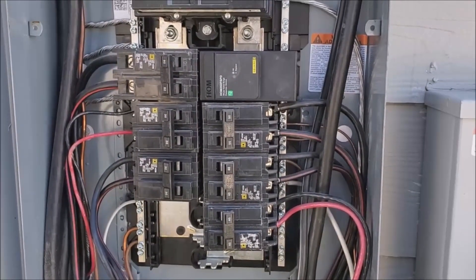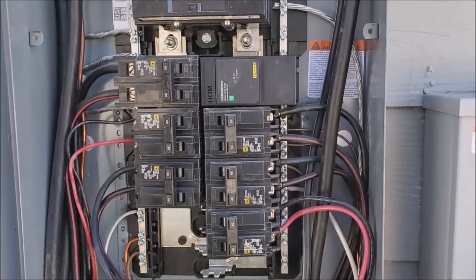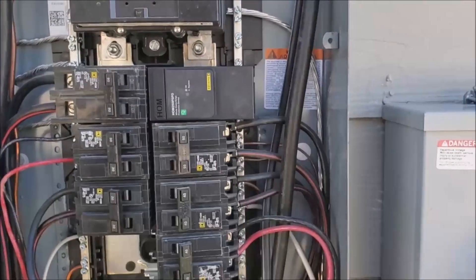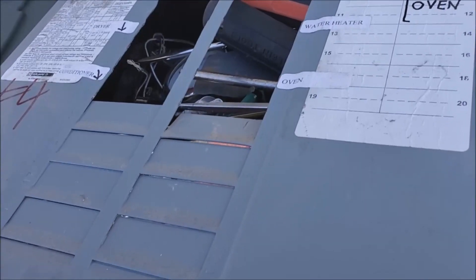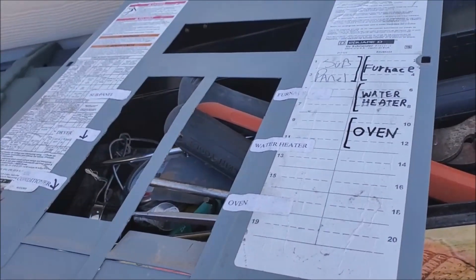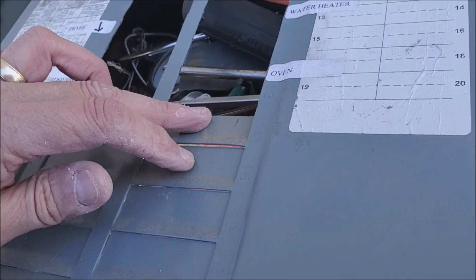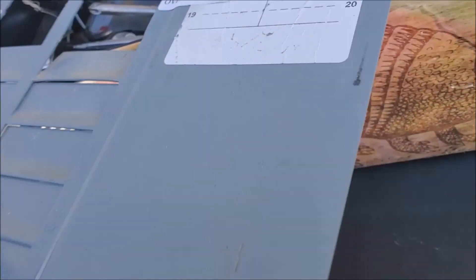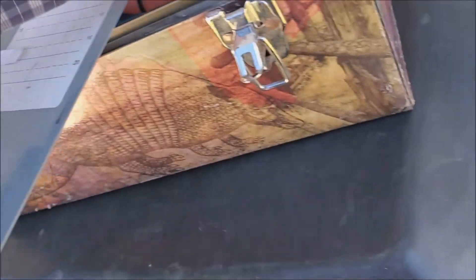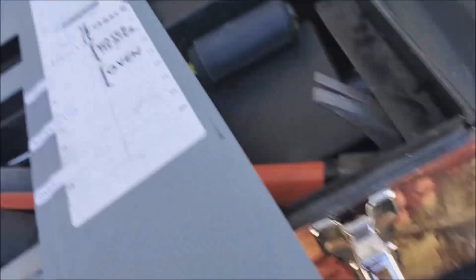That's really all there is to it. I'm going to put the panel back on and make sure the light comes on when I turn it on. Of course, before you put the panel back on, you have to knock out two more cutouts since you just moved everything down two spaces. I'm going to do that now — just using pliers here to push these guys off.